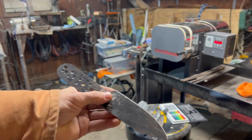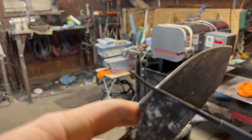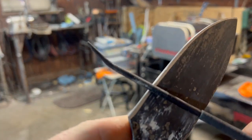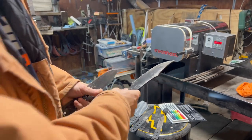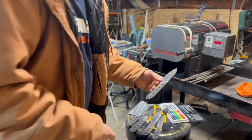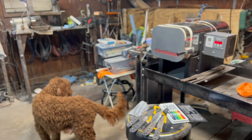So I busted out these knives, now that I got an oven. Here's a 65 HRC file and I just went to town — it dug a pretty good hole right through it. When I get the 60 HRC file, it doesn't. So the 65 HRC file made a notch in every single knife, which it should — it's 65. But what caught my attention is each notch was different; each knife felt like a different hardness, just by a point or two, which led me to reheat treat them.